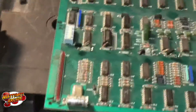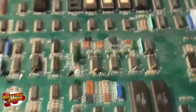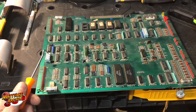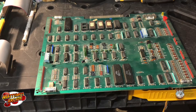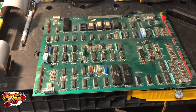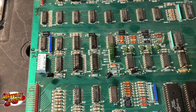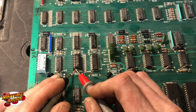I need to get back to the Tapper board because it is for a customer and this is just - well, I kind of need this board to help me anyway. All of these are coming up shorted, but I've pulled one leg and when you pull one leg and test it, it says it's not shorted. But then if you check the solder pads... I'll show you what I'm talking about - I'm sure there's just another one somewhere that is shorted that I'm not seeing. I'm trying to go through the circuit, just a little beep - nothing.